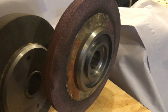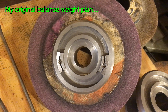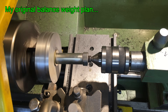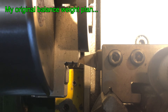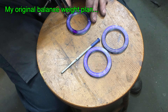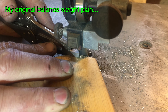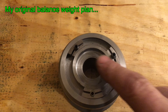Now that the arbor is done it's time to make the dovetail balance weights. I could make the balance weights like the ones you see here, but I think I might have been doing old farts day off when I put this lot together. The idea was sound enough but I should have machined two rings and then press fit one inside the other so that the joint face falls on the centre line of the grub screw — that way there wouldn't have been such a big gap when finished. Having such a big gap encouraged the grub screw to force the two weights out.